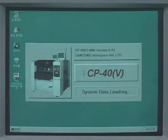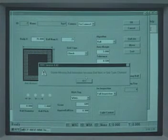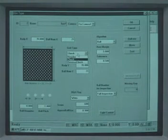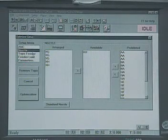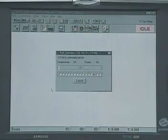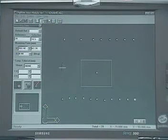The window system installed allows you to view many screens simultaneously, offering convenience during operation. The mounters are fully equipped with additional functions like a CAD interface, optimizer, digitizer, Gerber file converter, and line balance required by modern chip mounters.